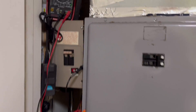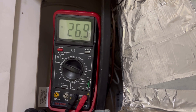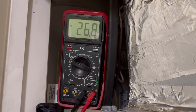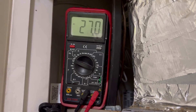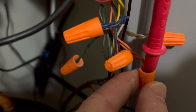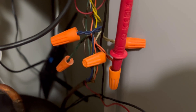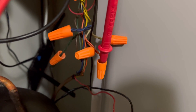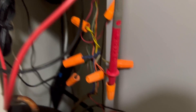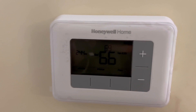So what I did was come over here, and as you can see we've got almost 27 volts. It calls for 24 but apparently that also works. There's enough voltage to make the valve change positions, which is what you're looking to get. You can see the orange wire here, my voltmeter probe is down in there, the black side is grounded to the air handler cabinet, and with the system on heat it makes the 27 volts required to change that valve position.